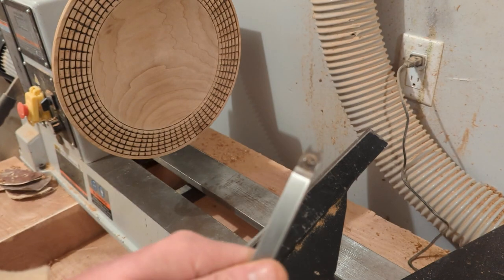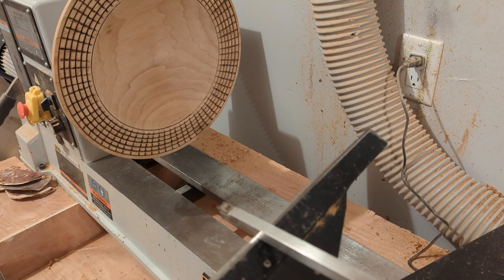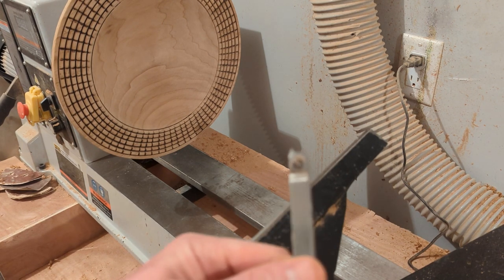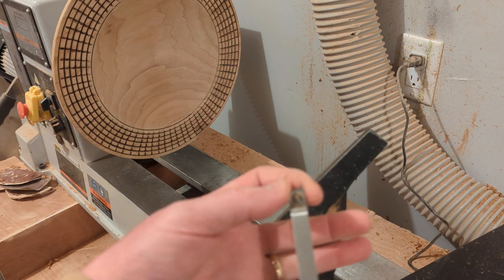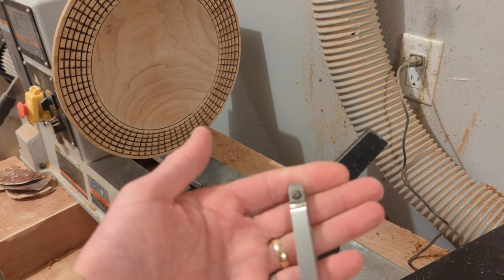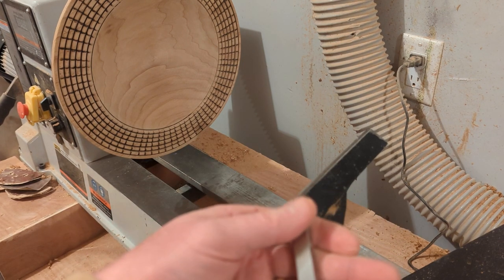What I did in this case is make sure I did a few fundamentals right. Number one, I put this on my tool rest and held it parallel to the floor so it wouldn't dig in, which helps reduce tear-out. The other thing is to push slowly and let the tool do the work. I used the beading tool to set the spacing, then switched to my skew to do the rounding over and do the majority of the cutting, as opposed to doing it all with scraping. Once I completed that, I went back with the beading tool just to refine the shape a little bit more.